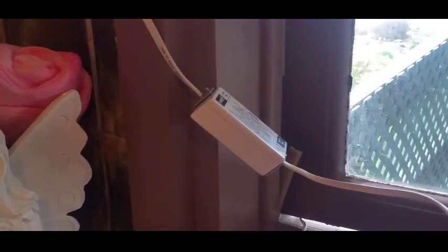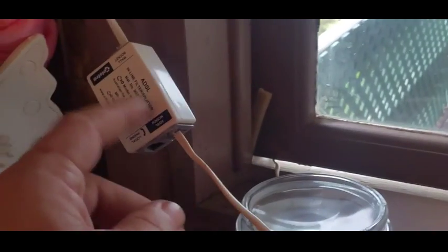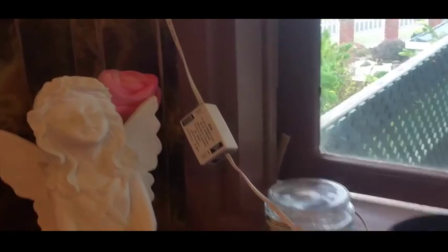I don't have a home phone, so for the purpose of this demonstration just assume I've got a phone plugged in here. This is pretty much standard — you get your line filter splitter from your ISP which goes in line with your phone plug. Now the age of my house means I still have this older style phone connection. Most Australians will recognise this; internationally it may be different. In newer properties you have what looks like an RJ45 plug straight into your wall. The splitter splits your internet from your phone and filters out any noise on the phone line.